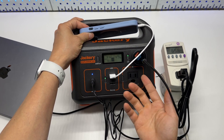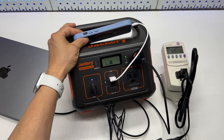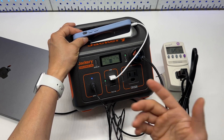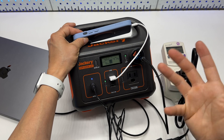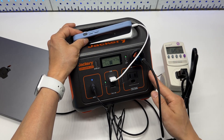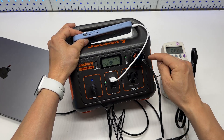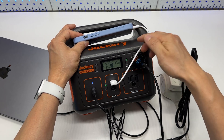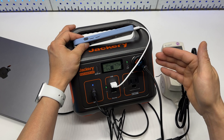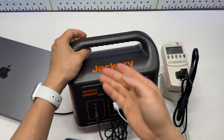The AC port is good for maybe charging your fan, powering a fan or TV. 200 watts is more than enough to power a regular TV, which only takes about 50 to 80 watts usually depending on the brightness setting. It's also good for a fridge, but those usually can run from the 12-volt port. You should take advantage of the 12-volt input whenever possible if you are camping.